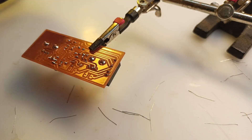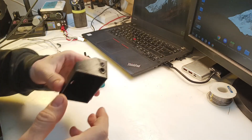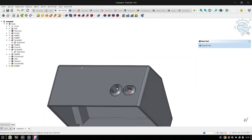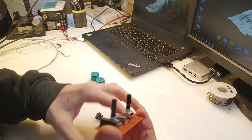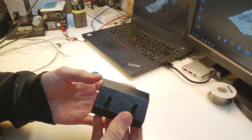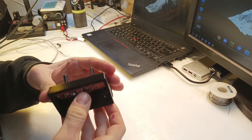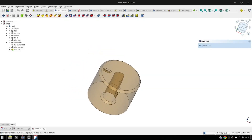The operational amplifier comes with an SOIC package, which could be a bit difficult for beginners. This is an enclosure for the PCB — it's a very simple model designed in FreeCAD. I also put the capacitors on the back side because I messed up some measurements. And this 3.5mm jack will be used as output for the headphones.